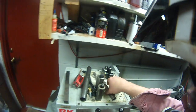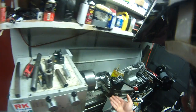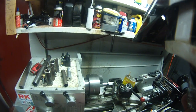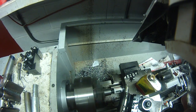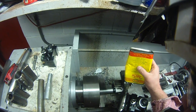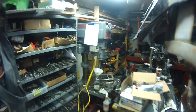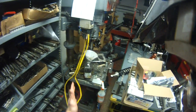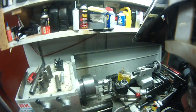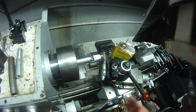I guess I already have that one in there, but the joints are super tight. It just takes some fiddling to get the height adjustment just right, but once you get the height adjustment it seems like this should work really well. I used to do it in a drill press vise on my big Powermatic, but that was a total nightmare — it would bind and wreck hole saws. This is much more controlled, and the auto feeding is awesome.